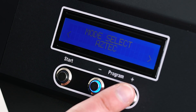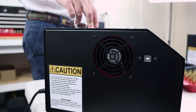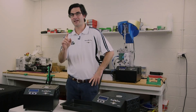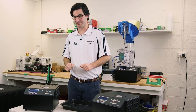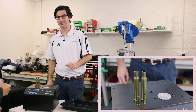A couple more features: as well as Aztec, we've included the original standard mode, which has all the preset programs for hundreds of different cartridges that we have tested in our lab. The Mark II also comes with vastly improved fan power so it will run all day with most cartridges. We've also built in a function which keeps the unit quiet when the extra fan power is not needed. Aztec mode on the new Mark II annealer makes it an incredibly versatile machine — from the tiniest cases to the largest, you will get the perfect anneal every time.